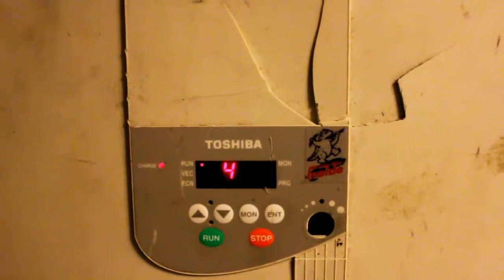Let's check the air temperatures. This is the temperature coming out of one of the vents inside the house. The indoor temperature as indicated by the thermostat is 76°F, and it is set for 75°F. It's coming out at 57.7°F — that's 14.3°C. It's 90 degrees outside. As I said, we have little to no superheating. Even at the actual register, it's still not that far off from the saturated suction pressure. The evaporator is pretty much full of liquid.